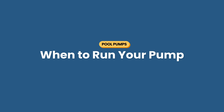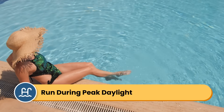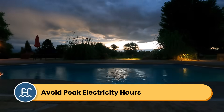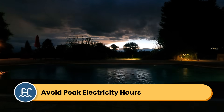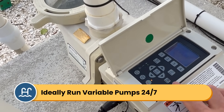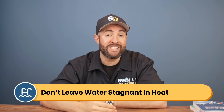So when should you run your pump? Timing matters just as much as duration. Some pool owners prefer running their pumps during the daylight hours when the sun is most likely to burn off chlorine and algae growth is at its highest. Others avoid running their pump at peak electricity hours in the evening. And some find it worth keeping their variable speed pumps running 24/7. Whichever you choose, just make sure that your water doesn't stay completely stagnant for too long, especially in the heat of the day. Running your pump only at night might save you some money, but it's risky if the water sits still during the hottest part of the day.